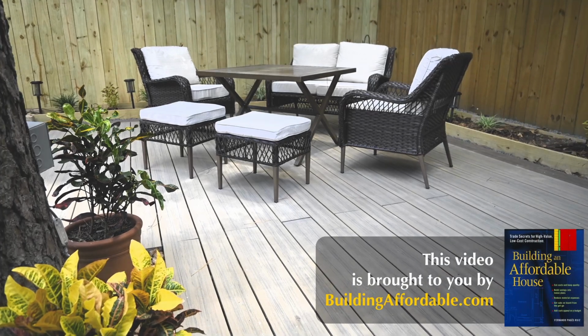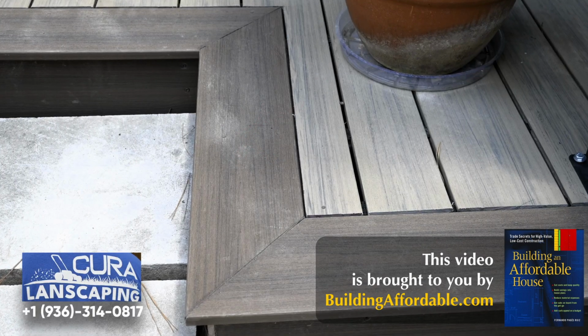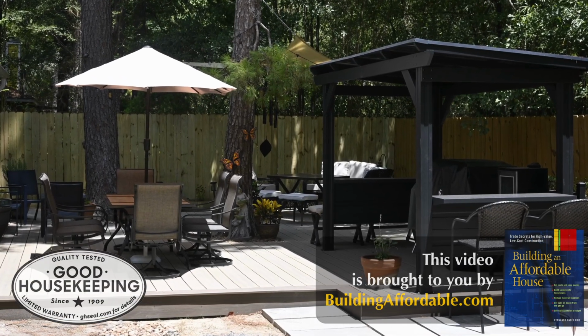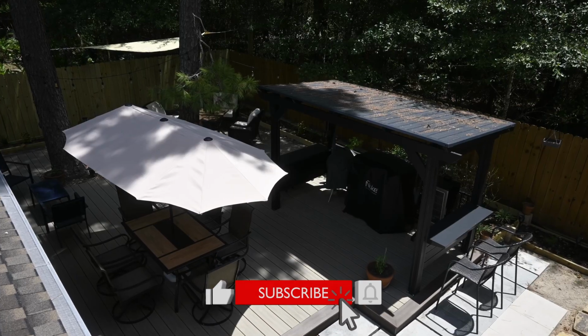This is a video about installing Deckorators' Voyage mineral-based composite decking. This is one of two decking varieties offered by Deckorators. The other is a wood or cellulose composite. I preferred the mineral-based due to its heat resistance and low thermal coefficient, which means it does not expand much in our hot Houston summers.